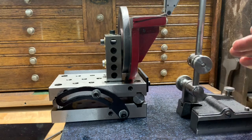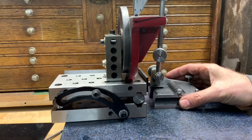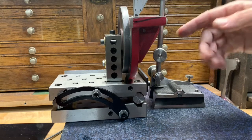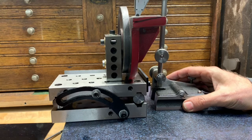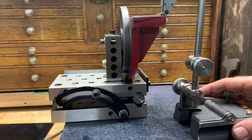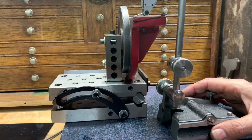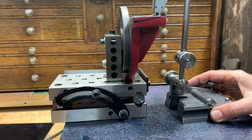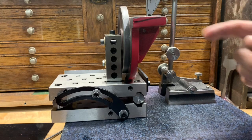So I set this up and I have an indicator here. I'm moving this around and I was able to get it straight this way — I have two screws on the back. I've got that dialed in and I'm moving this around. I can see it's pretty much on zero here and it's within half a thousandths on zero over there. In the next video I'll show setting the angle on this and then I'll be bringing it over to the grinder to get that fraction of a degree change.